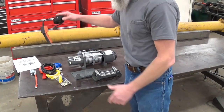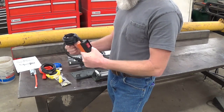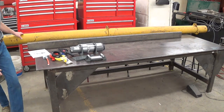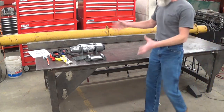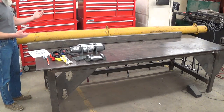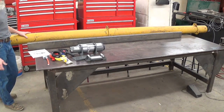It came with all the controls and switches — this is the in/out switch. We're going to have to figure out how to hook this into our fork system, and obviously the cord will run up to the winch. This piece I intend to use for the main boom part — it's a part off of an old combine that I scrapped out and saved years ago. I'm using round stock because of rotational flex: with 300 pounds on the end at full 90 degrees, a rectangular piece would twist and counteract our leveling system, causing a lot more stress. Round stock resists that twisting force the most.